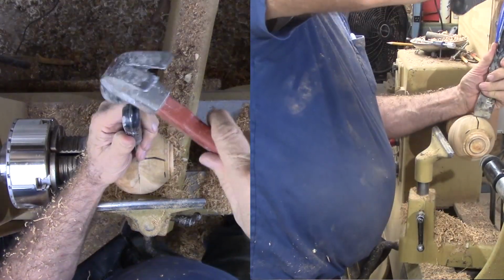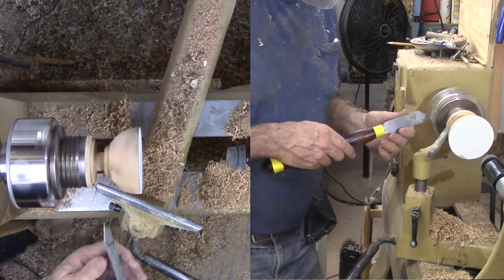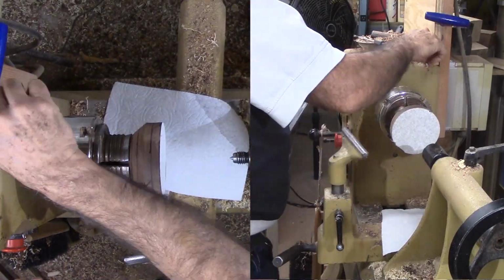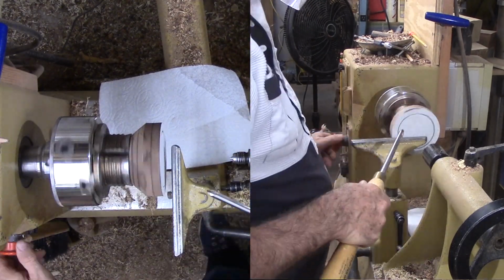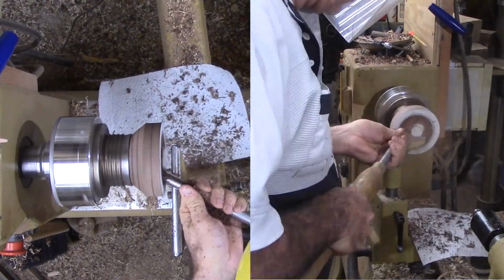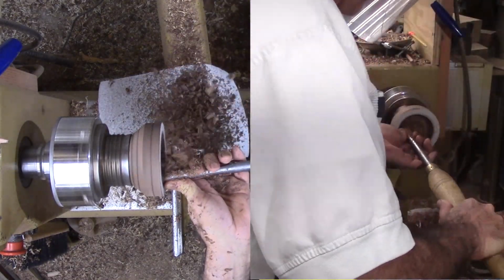While the sphere is still rough and still in the tenons, I take a thin knife and hammer, and with a few taps on the paper joint, the sphere splits into rough hemispheres. Remember that tenon I cut earlier? Now I can use it to mount the hemisphere while I hollow each half. I measure for a 3/8 inch wall thickness and note the half diameter. Then, starting with a spindle gouge but quickly switching to my bowl gouge, periodically I stop to measure the depth.